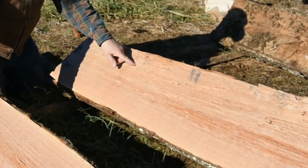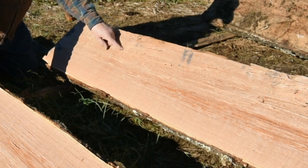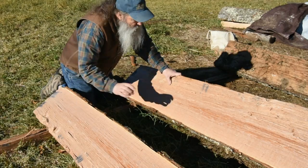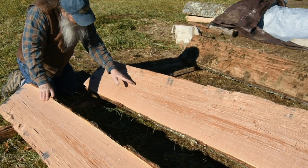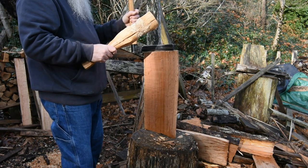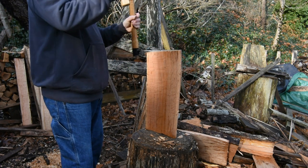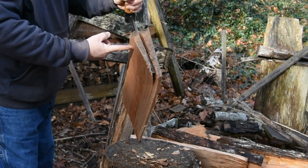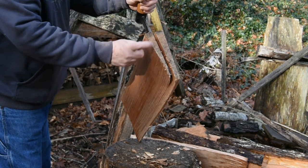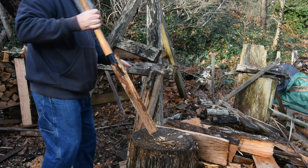It's split off the juvenile wood here. You can pick up that there's a knot right here, another one just six inches away from it, a third up there, and one at the end. So I'll drive a wedge in the end and try to break this down to about here. This could very well just be trash — might get some narrow, thin stuff out of it, but I expect it will run up here. Let's find out.